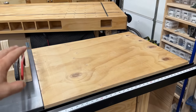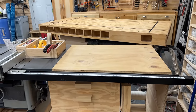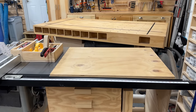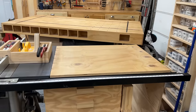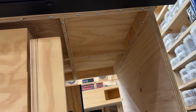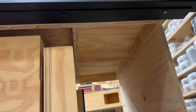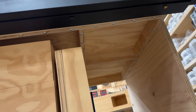Let's talk about this extension piece of wood at the end. If I did it again I'd probably use MDF, because it's all about keeping it flat as long as possible. I chose plywood and it's still perfectly level, but knowing what I know now I'd use MDF. I built it similar to a torsion box top; if I did it again I'd make it a full torsion box, which would have eliminated the excessive amount of screws I ended up using underneath.